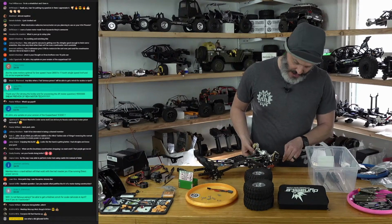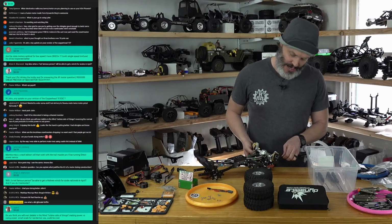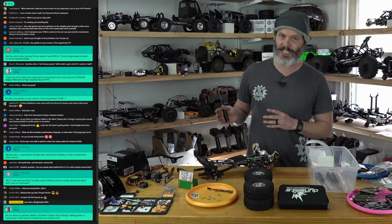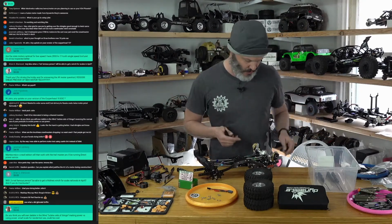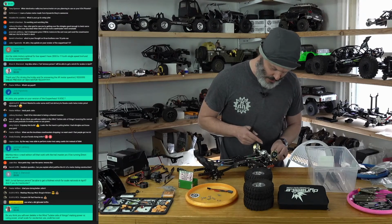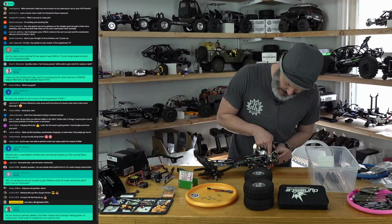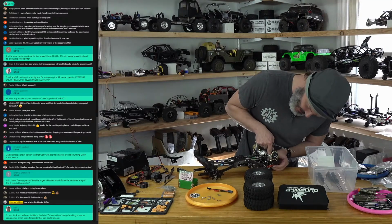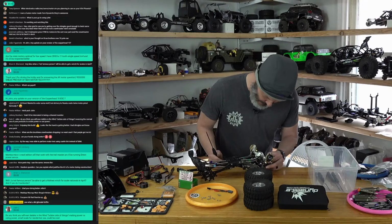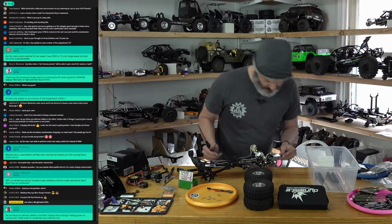but this would actually get you a true kV measurement that is still, at least with a brushless motor, tainted by any inefficiencies your ESC may be causing by either retarding or increasing your timing. However, at 0 amps, we can assume that the motor is technically doing no work at all, and there is your idealized kV from a motor system. You would divide it by the 10 volts that is driving it, of course.